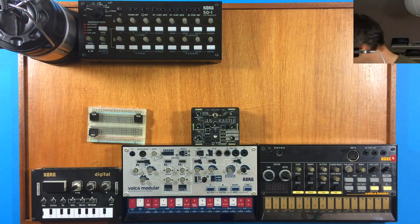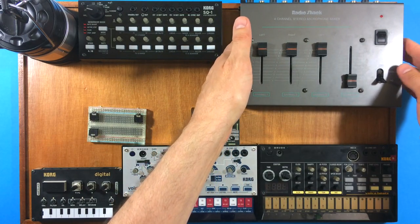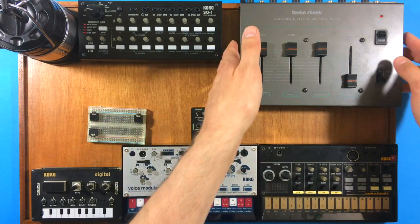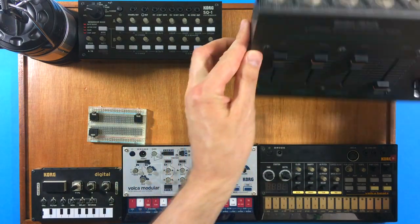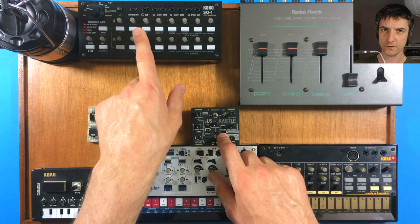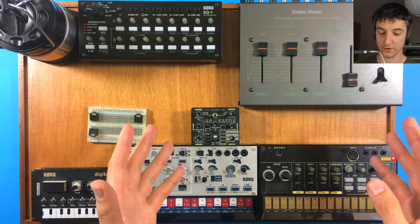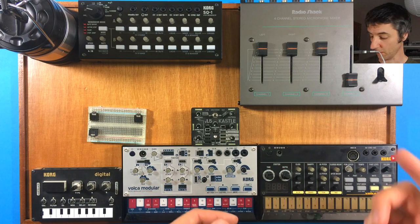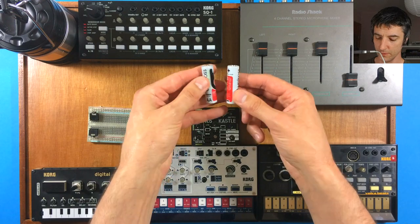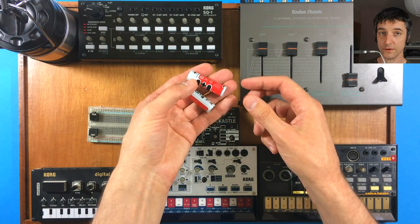Next up, mixer. This is the only battery-powered mixer I actually own. It's really old — probably late 80s, early 90s — but it runs on a single NiCd battery. All the other stuff so far runs on double-A's: this one's on three double-A's and these are on double-A's. I have lots of rechargeable batteries and chargers. I've just invested in loads of these hybrid-type nickel metal hydride batteries, which once charged and left on the shelf, don't self-discharge as badly as earlier NiMH-type batteries.